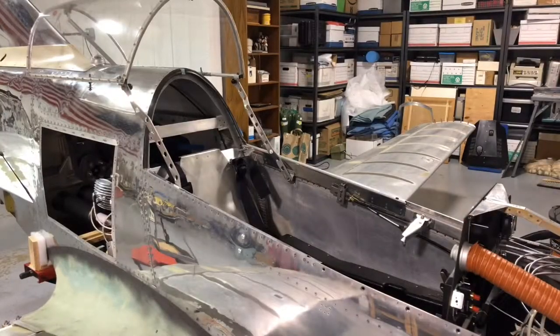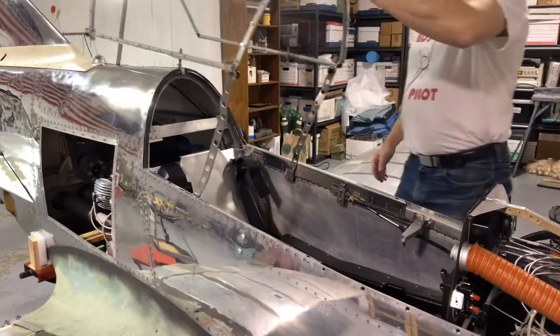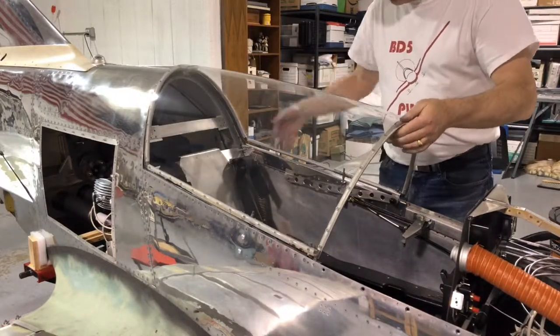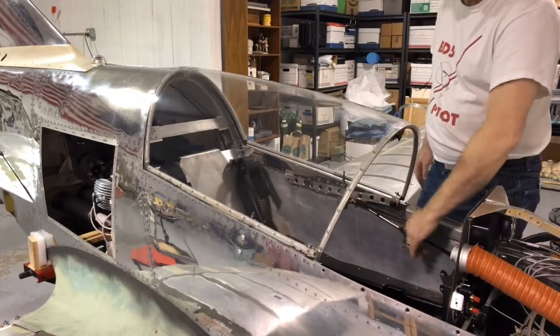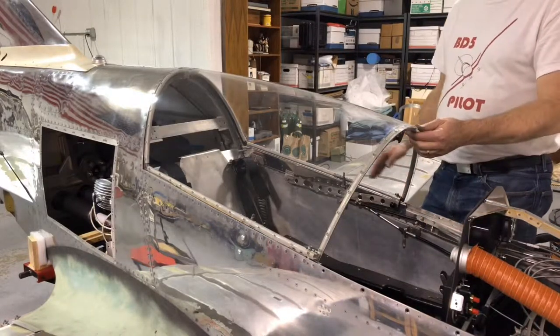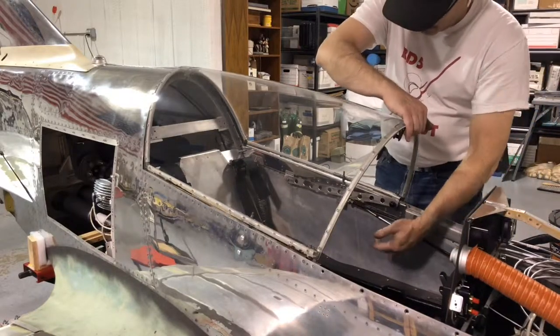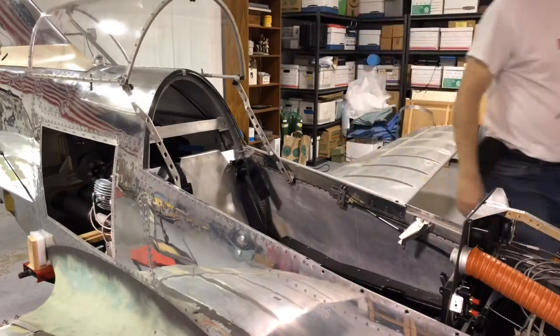I'll set up a tripod so you can watch the whole thing work. Now you can watch how the handle operates: I'm still going to make the pins for the back so they line everything up correctly, but as soon as the canopy drops into the right spot, you bring it back — that opens the clamps — then bring it forward over center, which locks the canopy down very securely. To get it out is still a little tight so it takes a little jiggling, and then it comes up. Success!